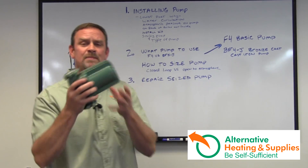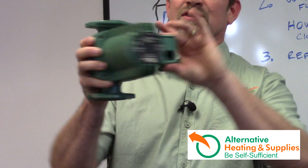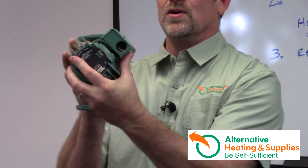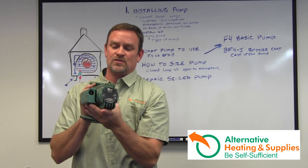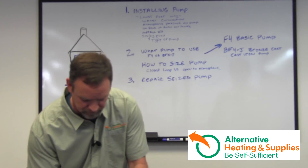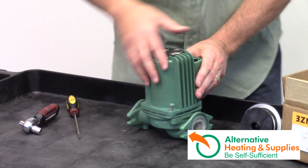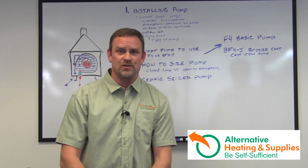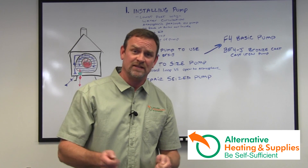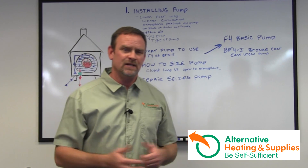One more thing — a lot of people ask: if I mount it like this, can I turn the motor so that the electrical inlet is out of my way? Sure, no problems. Then you put your bolts back and secure it up. What I do is take the electrical lines, wire tie them to a plug, and just turn it on — just plug it in. If I hear it spin up, I'm ready to go. If it doesn't spin, you need a new pump. But that's really all there is to it.